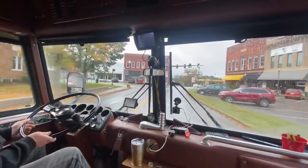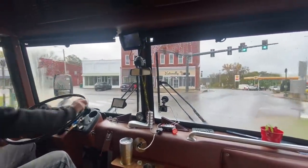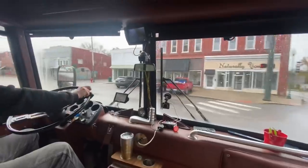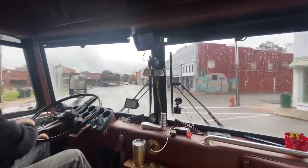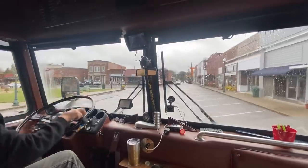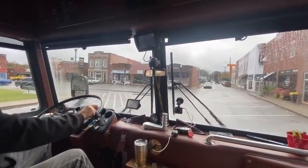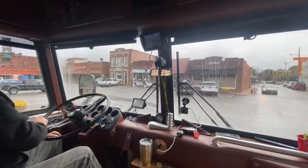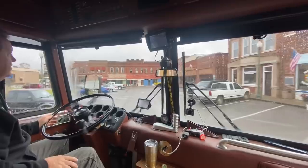You ever heard of a HEPVO valve? It's a waterless P-trap, and you can put that under your sinks and in your bathroom and under your shower and stuff like that. And then you'll never have the sewer gas smell when you start driving. Nice. Because the P-traps won't clear out. It's basically like a flat tube. Water can flow through one way, and when there's no water in it, it lays flat and seals it off. It's like a little duckbill thing. Water flows through it only one way.